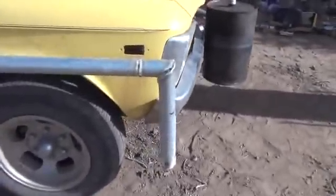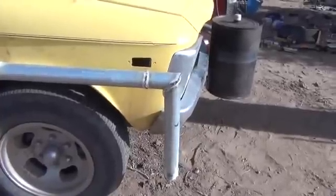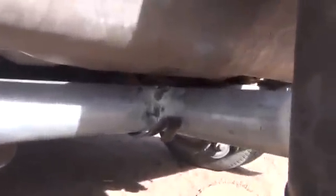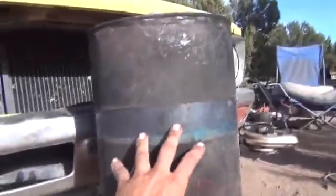You can see I actually ended that corner just behind the headlight, so there would be no glare or any interaction with the headlight and the pipe. It drops back down up underneath the bumper. Let me go underneath and show you — basically I've got a hole saw hole. I angled that piece of pipe, and that's now running into the bottom of this 5-gallon oil can. I've still got to put a little tap out so we can drain anything that catches in there.